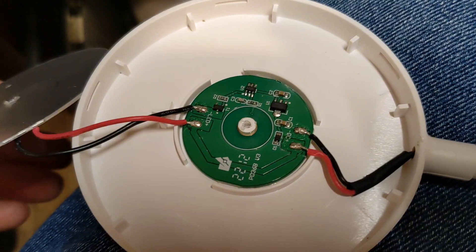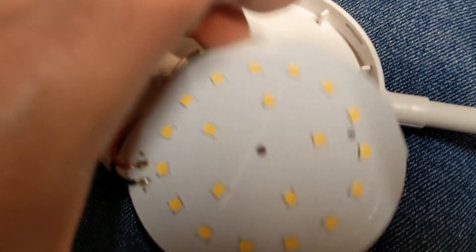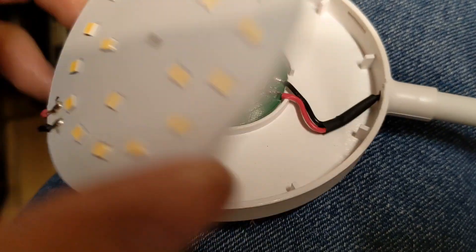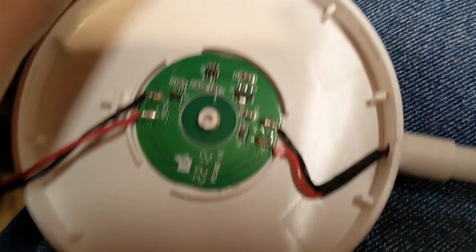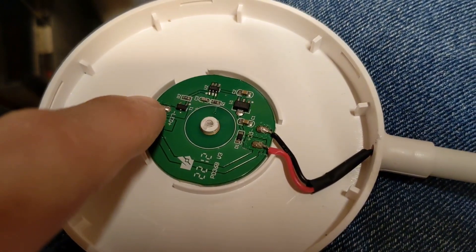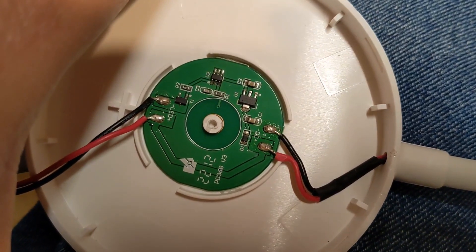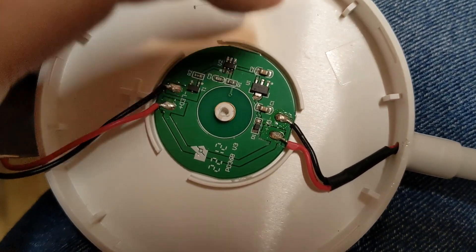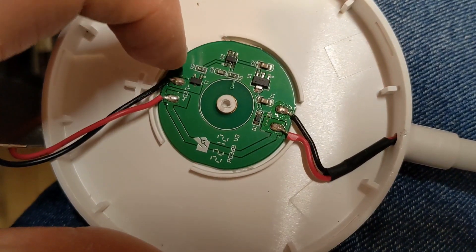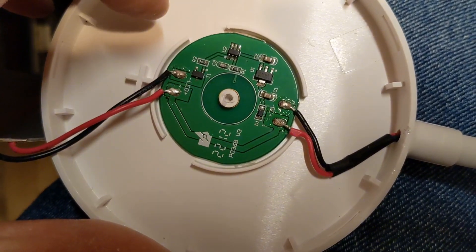Let's take that screw out. So we've got a board of LEDs on it. I'm not sure there's any current limiting on there. What I initially thought was putting the negative from there - it's a negative - and that should light. Is there any current limiting going on? That's probably the IC there with the touch sensor on it. There's a voltage regulator I assume, and that transistor is literally switching to ground.